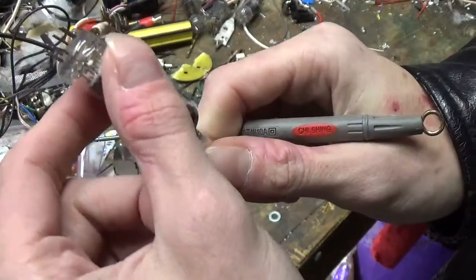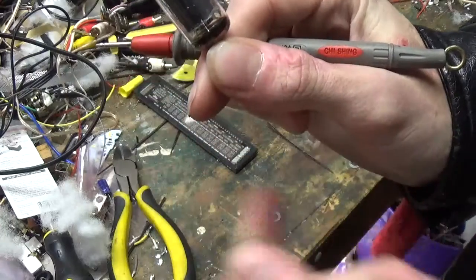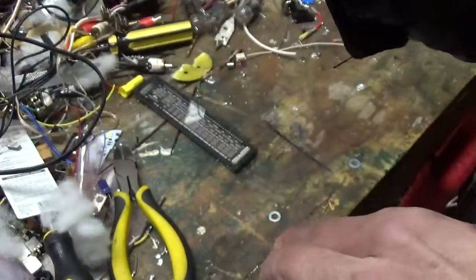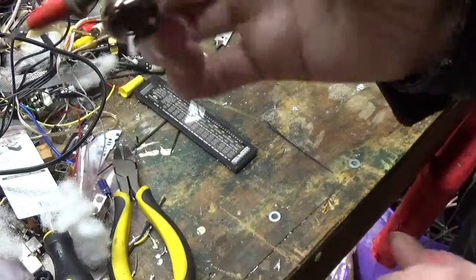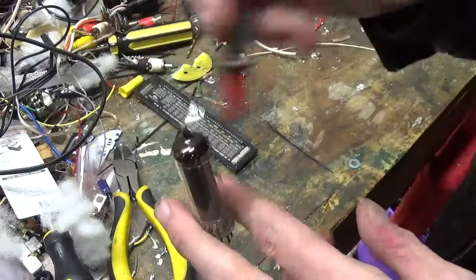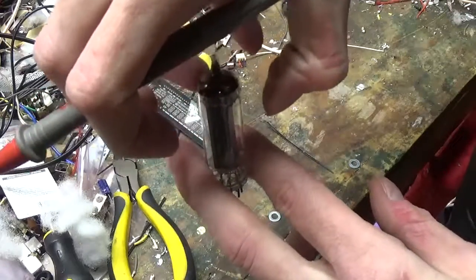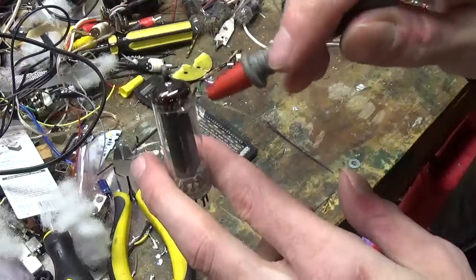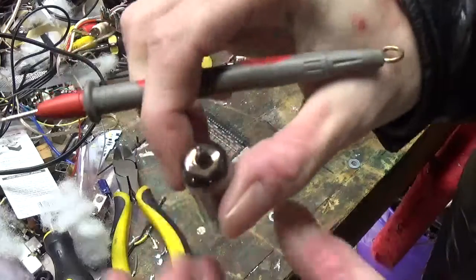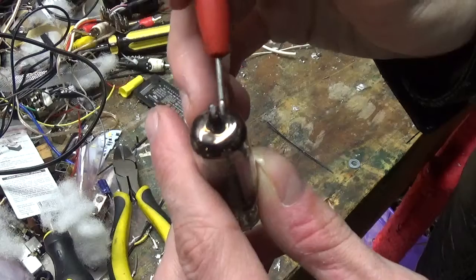Now they put that rod into the vacuum pump. They suck the air out, and while it's under vacuum, they use a heating torch and they clip that right off. Now it's sealed. Then at that point, they flip them into this coil that comes down around it. It heats it up with high frequency. You'll know it's heating up because it'll glow in there. It'll heat it up, and then all this will go from being clear glass to this metallic, silverish black.